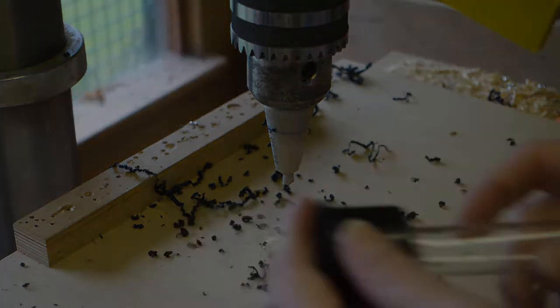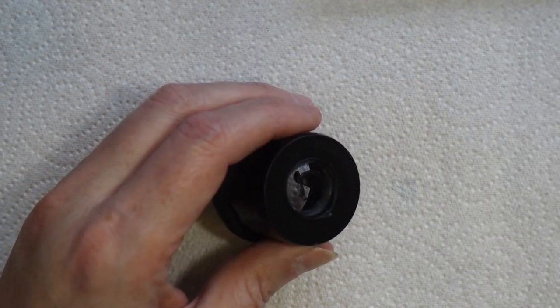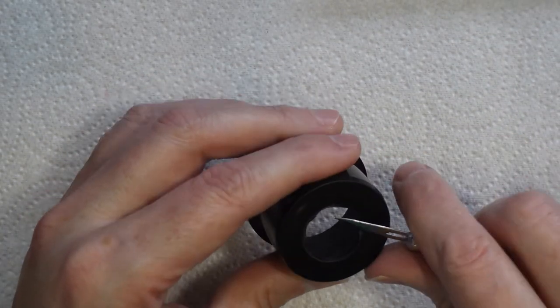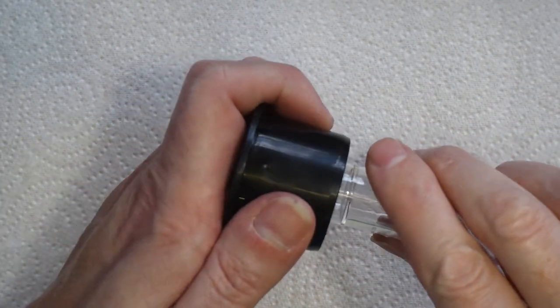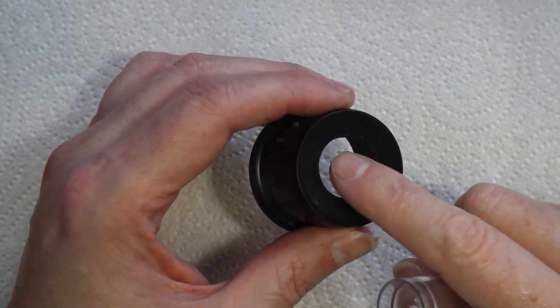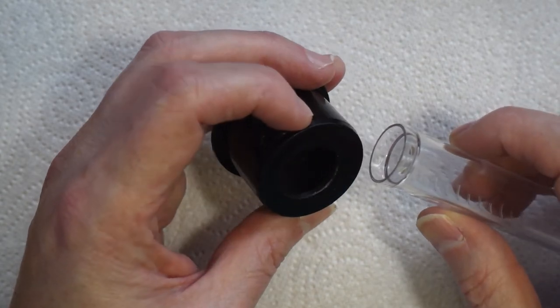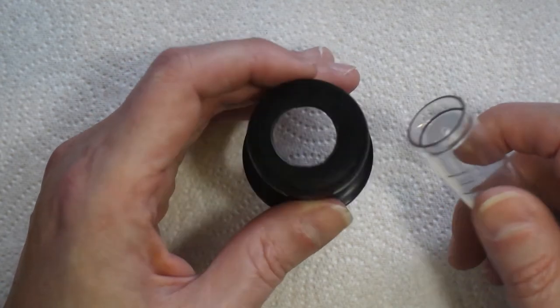Back at the bench, I'll just take a knife and clean this up, sand it very slightly on the inside, and that will fit nicely. What you've got to remember when using conical drills is they don't cut a straight hole — there's a bit of a bevel, so take that into account when you're drilling. You could cut this out with a Dremel or a hobby knife — I just use the drill press because it's much easier.